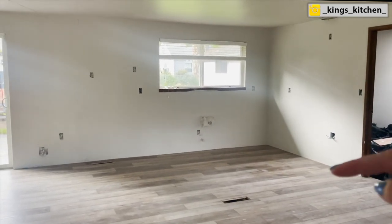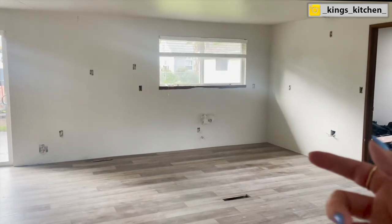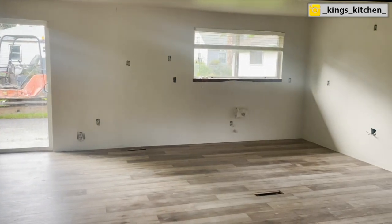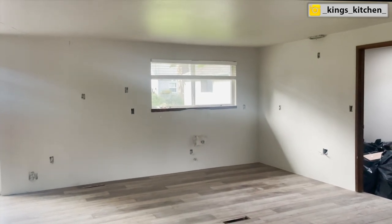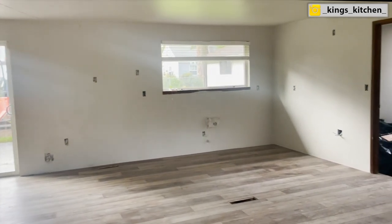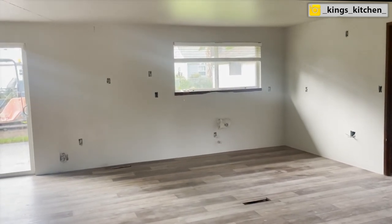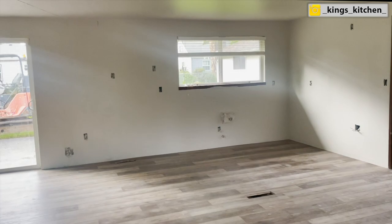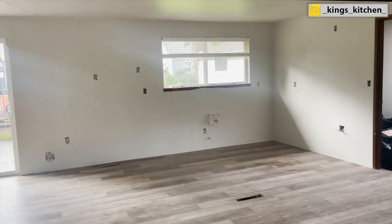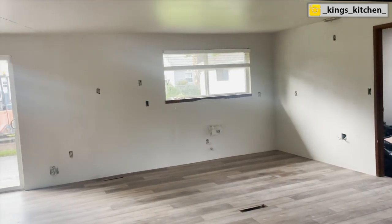Another really important measurement is from the bottom to the ceiling. I always recommend measuring in two different sections — on this end and then on this end — to determine your ceiling height. This is going to tell you how tall your wall cabinets are, whether you have any tall cabinet units, how tall they can be, and also what your crown detail is going to look like. Once you measure the overall room, you do a little sketch. Any designer can work off of a top view — that's all you need.